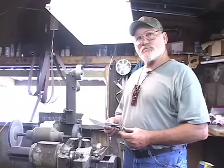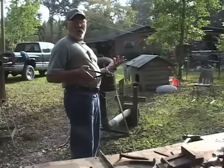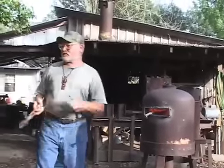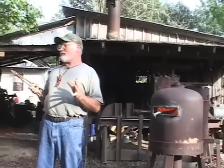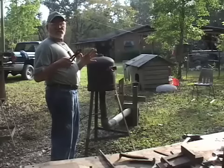We're going back outside to the forge. What I'm going to do now is temper the knife — basically harden it so it'll hold an edge. Being this blade's been beat out, all the molecules are distorted and in different shapes and different sizes and different places in the steel, so nothing's equal. So I'm going to heat this steel up red hot and let it cool about four or five times. That's called normalizing — to get all the molecules to flow evenly. That's to keep the blade from cracking.